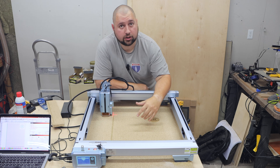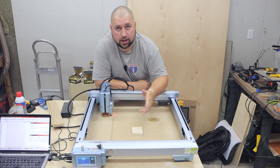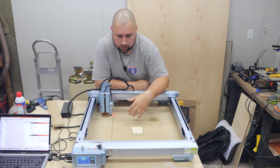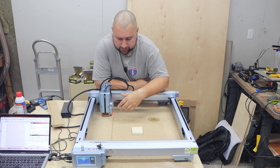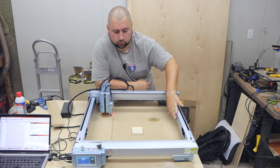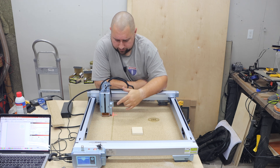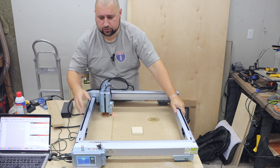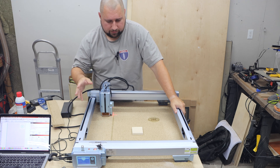The burn is done and I couldn't be happier with how this turned out. I've got perfect placement — if I want to burn at 200 by 200, I can put it right there and it's going to be perfect. Some of you may notice I didn't use the full burn area; I did a 400 by 340 grid. The reason is the laser on the ultra is offset by 52 millimeters, so if I go the full 400 it's going to crash into the wall. If you don't use the laser you can do 400 by 400 or 410 by 410. The laser will help me align everything perfectly every time. Also, if I need to lift the machine off and put it on something bigger — say a dining room table — I can pick it up, burn my logo, put it right back onto the spoil board, and use my grid like it never even changed.